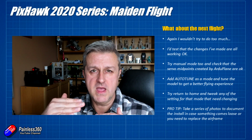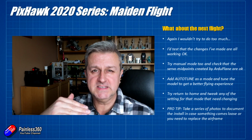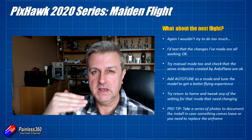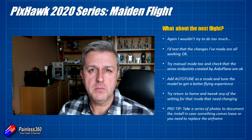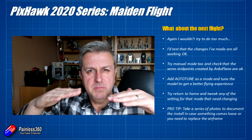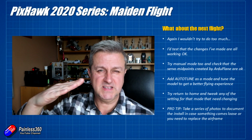Now in FBWA, the limits for the pitch are also set, but I wasn't getting anywhere near that because of the mechanical limit of the servo movement. Next time out, I'll probably have a go at manual mode. The servo things should be all set, because it should be flying straight and level with the nose very slightly up, which is absolutely normal.